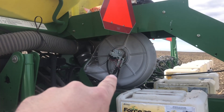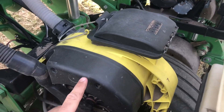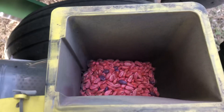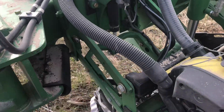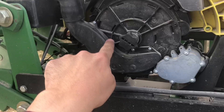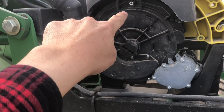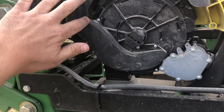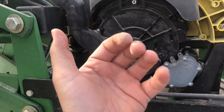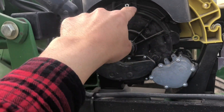There's the big blower on the back of the planter that blows the air to move the seed from the big seed tanks out to the little mini hoppers on each row. If you look inside here, there's a little bit of seed in there. This hose is the hose that brings the seed into the mini hopper, and this hose is actually a vacuum hose. Behind this door there's a rotating seed disc with holes all the way around the outside, spaced out properly to pick up and drop seed. The vacuum hose is sucking air through this side of the disc, so the air is coming through those holes on the seed disc as it's rotating, and it picks up a seed out of the mini hopper.